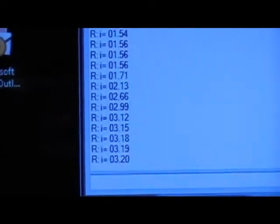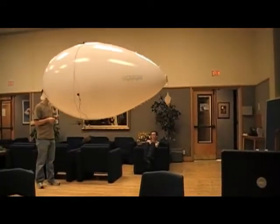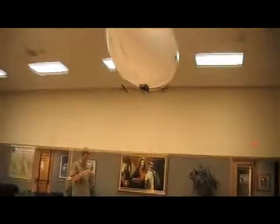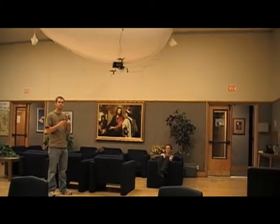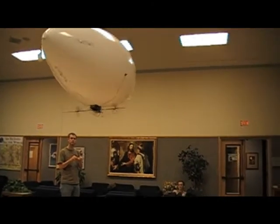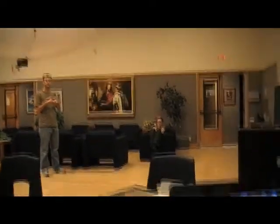Using the propeller speed to calculate thrust, the current velocity to introduce a drag force to the model, and the gyro heading to gather the direction of travel, we can calculate velocity and position with much more precision, negating the integration drift that is such a problem in true dead reckoning systems. By using the accelerometers as secondary sensors, we can use their data whenever extreme acceleration values are present. This allows the blimp to account for collisions or unexpected movements and adjust accordingly, combining the sensing capabilities of the accelerometers with the consistency of the propeller thrust.